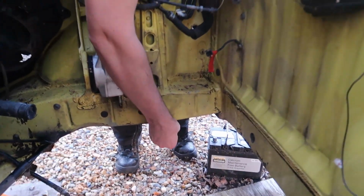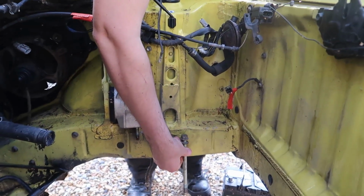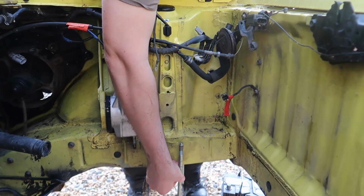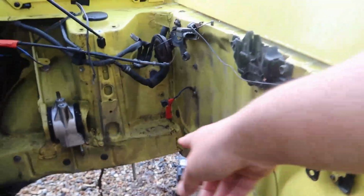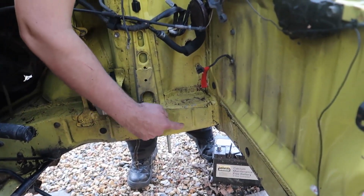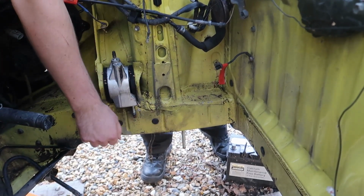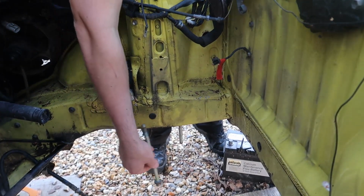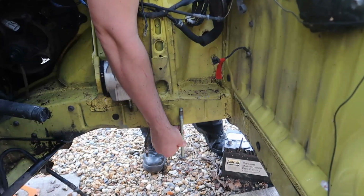All right, so where that bolt is, the captive nut of it is lost, so we've got to cut a hatch in there, I guess. Yeah, you can't get to it. So between those two indentations, can you point to those? Between that one there and that one there, we cut a rectangle out of it with the little thin slip discs. Have a look at what we've got going on, and then hopefully weld that exact piece back in.